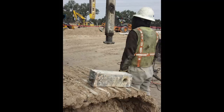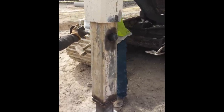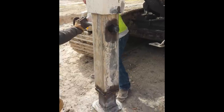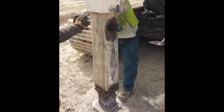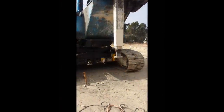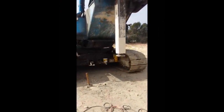As you can see, that piece coming down off the machine — I already started gouging off around the pin and around the base to get some of that weld off. You'll see in the next frame I've gouged all that off, knocking that pin out. I gouged around the perimeter to get that weld off. Being that it's so full of dirt and sand it becomes a challenge to get knocked out, so we use the machine itself to kind of knock it out. It takes a little while to bust it loose.